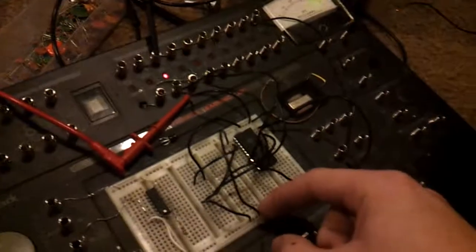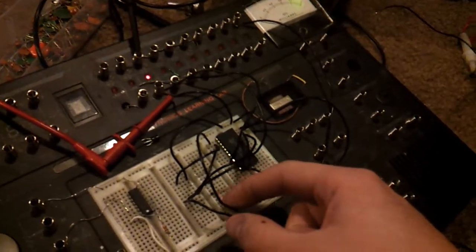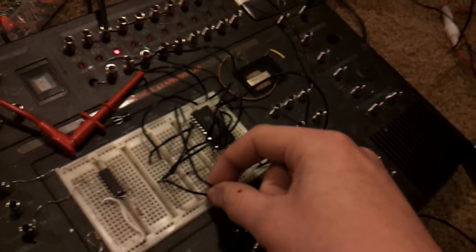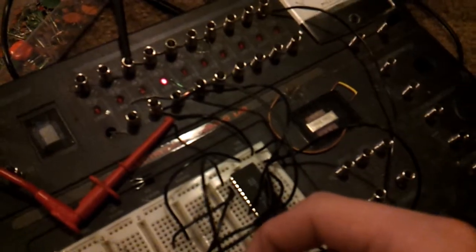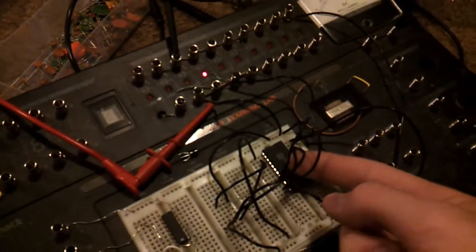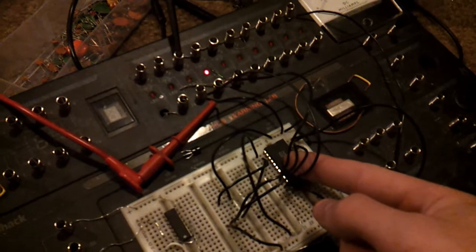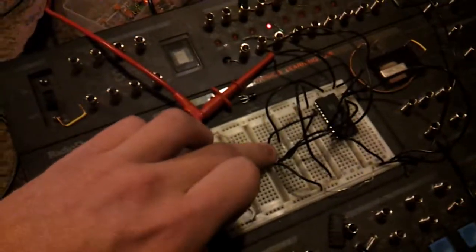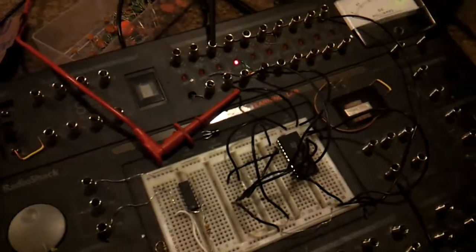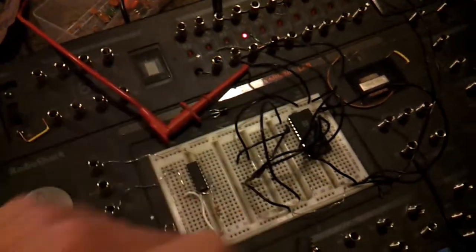It's a pin that should be labeled LE on the chip, and after you switch the value of this chip, the light should switch. Now if I pull it, the light switches. Why is this? It's because inside here, all of the transistors that you turn on with these pins will switch between the different values only when it's refreshed.